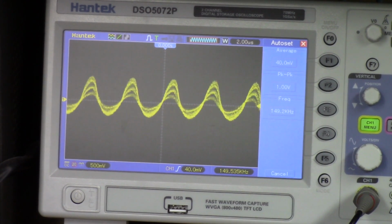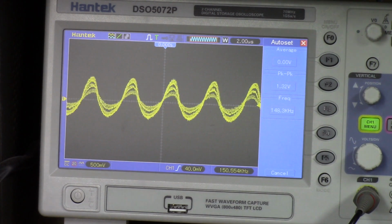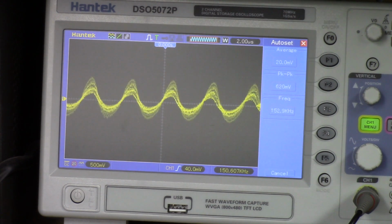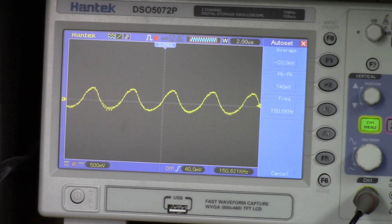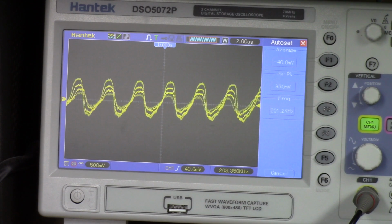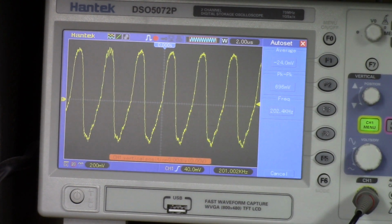Alright, here it is on the scope, and it is putting out. Right now I've got the signal generator set on about 150 on the scale. The display reads 150.53 kilohertz. If I lock my display, it's 149.7 kilohertz. But again, it's varying between 148 and 152. There's one right there where I locked it right on 150. Let's take it on up to the top of it. That's 200 right there.